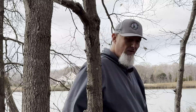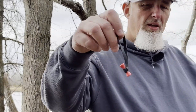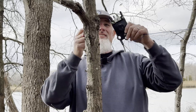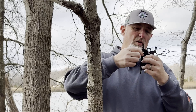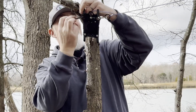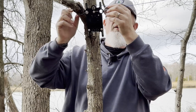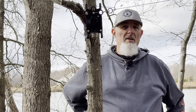All right, we're at the feed point end now. We're going to hang this up. Chameleon gives you this little rubber band thing with a little clip on end — makes it really quick and easy to hang up the feed point. So this is perfect and ideal right here. Put the rubber band through this little piece here and clip it over this branch. It gives it a little spring relief. We're going to hook up some coax and then get on the air.